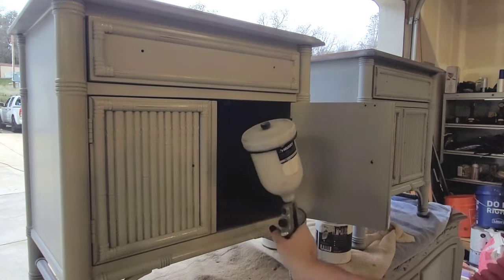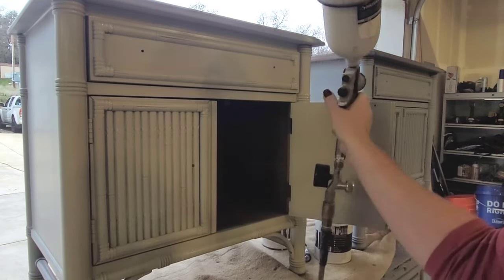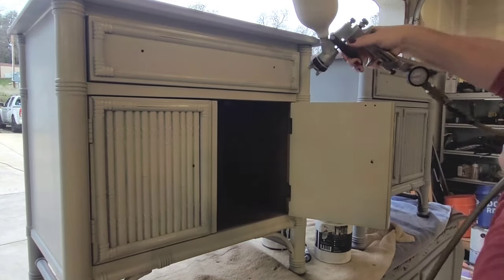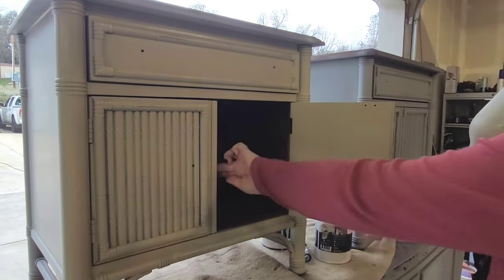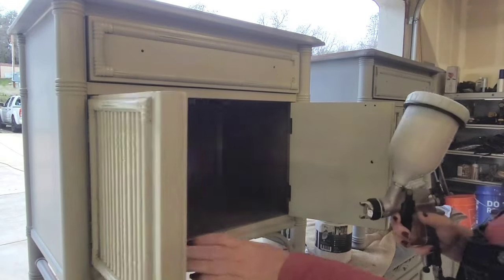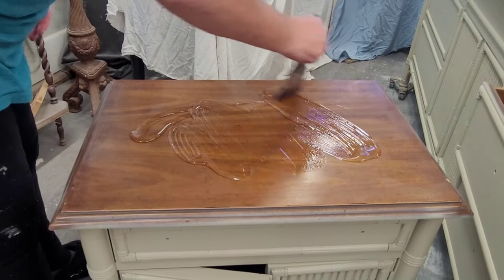I'm going to open up the doors on the nightstands and get the back side of those as well. I have another plan for the inside of the nightstands, but we'll get to that later. This will take two coats sprayed — on the first coat I could still see a little bit of primer peeking through. It doesn't need to be a perfect coat, but you don't want to over-spray and get it too heavy in spots — I'd rather come back and even it out with the second coat.